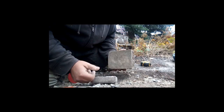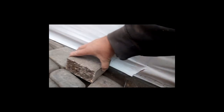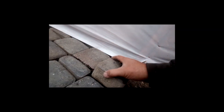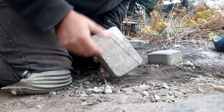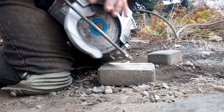You can show off to all your friends how you cut a brick just with that chisel. I like this technique because the rough edge matches the cobble. Take that sucker out first, drop it in — I like that rough edge rather than the smooth. Sometimes, though, you got to kick it up a notch.